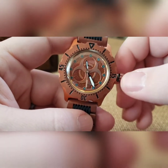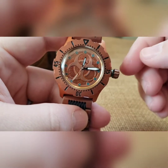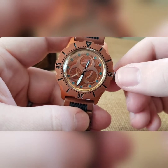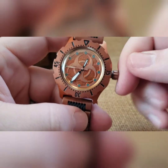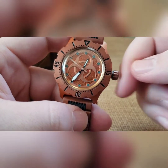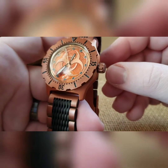It doesn't have a hacking movement so it's going to keep going. It also has a wobble crown that deflects lateral pressure from going into the stem and into the movement — if you push sideways on it, it will deflect that. If you pull it out straight you won't even really feel it. Whenever you're done time setting, push it over, take it out of the time setting position, and wind your crown back down. That is the build.